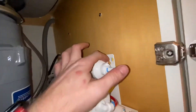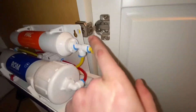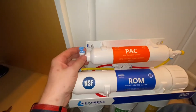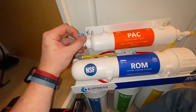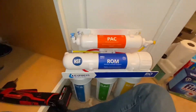That was definitely one of the best uses of this right-angle drill I've ever had. So there we have it — screwed most of the way in, but enough where we can still get all of these fittings. Our water feed is going to be coming in here, this will be going to our drain saddle, that's going to the water tank, and on this side — yep — the faucet. That actually faces up so I can pull this little quick clip off right here. I'm going to hook that in first so I can install it and run that cord up there later.